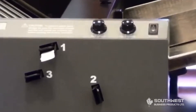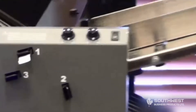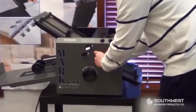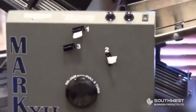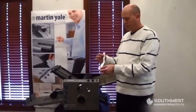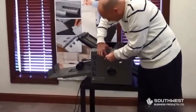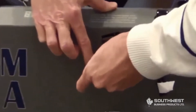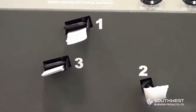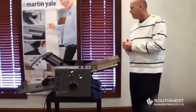When the paper has run through the first fold plate and enters the second fold roller, it has been folded once, so now you have two thicknesses of paper. You fold a piece of the torn strip over, pull the tong out, slide it in, and the roller is gapped for two thicknesses. Coming out after a letter or Z fold the paper has been folded twice, so you need three thicknesses — you pull the tong up, slide it in, and the roller is gapped for three thicknesses. There are corresponding tongs on each side of the machine, so you need to do this to both sides when setting up for a job.